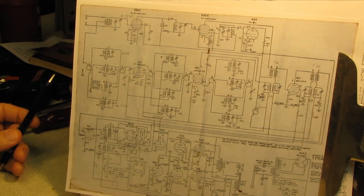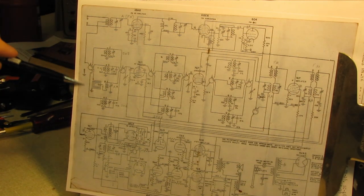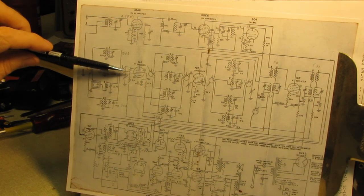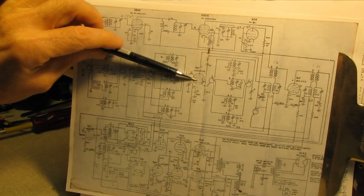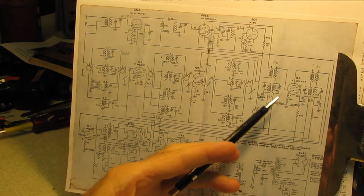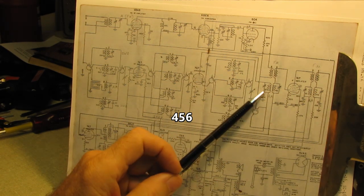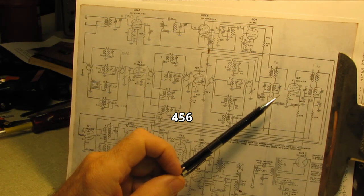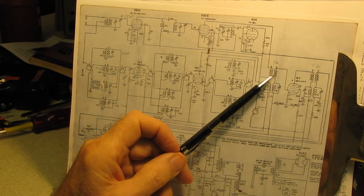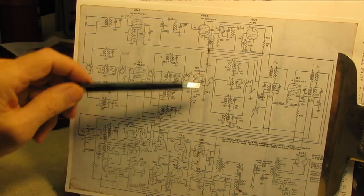The AM antenna is a separate antenna here, excuse me, for the three shortwave bands. This is your AM loop antenna that you saw. So this is selected for AM and goes into the RF amp for the AM, the converter for the AM, and then the common IF chain. They use 455, I think it's 455, I'll have to look at the paperwork. It's either 455 or 456 for the IF on the AM. And they use 10.7, your common 10.7 megahertz for the FM section. And that's selected through these band switches here.